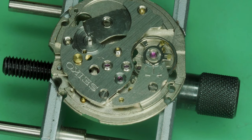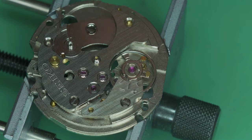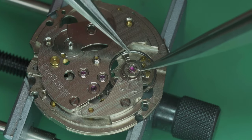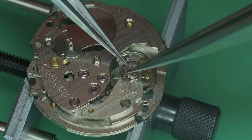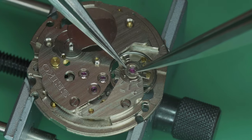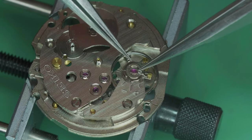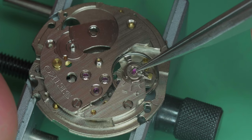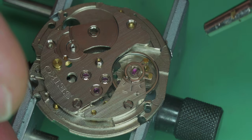The holding spring is slightly larger in size but again slightly curved. While the assembly looks similar, the function is different — the escape wheel and third wheel assembly is not a shock-resistant device. If you drop the watch, the jewel will stay in place and will not move or prevent any damage to the pivot of the escape wheel. In conclusion, there are a number of reasons why Seiko opted for an assembly with a cap jewel for the escape and third wheel. Reason one: the cap jewel prevents dust and other particles from entering the jewel bearing, which extends the working life of the bearing and pivot.